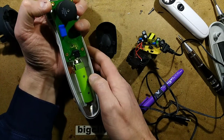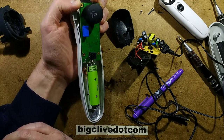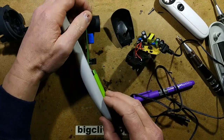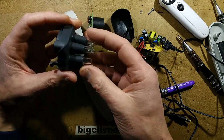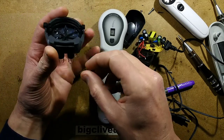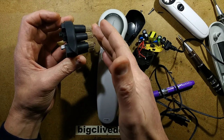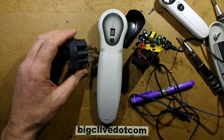So the whole thing - it's quite well made I have to say, quite neat. A serious amount of design effort has gone into this for a product that is potentially slightly quacky - they may not consider it quacky, they've probably convinced themselves it's real. But it does hark back to the quack era of the violet wand type products. It does have the effect - it's not as fierce as the mains one, but it certainly seems to do what they expect it to do, even if it's not necessarily going to cure baldness. It does have a sterilizing effect and creates localized ozone. I do think they could have saved money by using just standard neon lamps with electrodes already inside - that's an off-the-shelf item rather than getting custom-made neon electrodes. But yeah, it's an interesting device. Thanks to Gordon in Canada for sending this through.